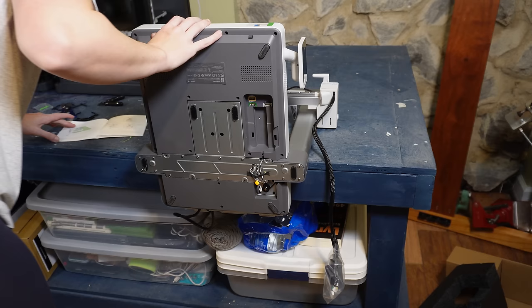Here's the final product on the risers. The top part — you can see the paper kind of stuck with the glue — I could scrape that off, but the AMS is just going to be sitting on top of it, so it's not a big deal. We're using clear double-sided tape again — I'll link it in the description. I forgot I have to route this PTFE tube through a little hole back there. If I put the riser on top as-is, it's just going to crush this PTFE tube. There's a little hole back here, so I'm going to take it out of these little clips and feed it through the hole.